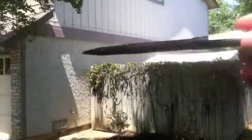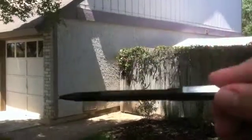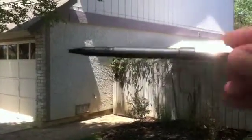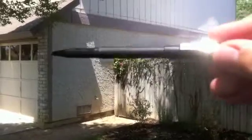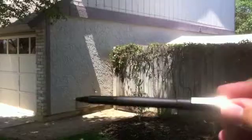On the stucco, we're going to be doing a spray method and then back rolling the stucco to get it in all the pores of the stucco and all the little gaps. This board right here I don't want to replace because it's right next to the stucco, and if we take that off we could possibly damage the stucco, so we'll prep it and paint it. Got a little damage at the bottom, we'll fix up here,